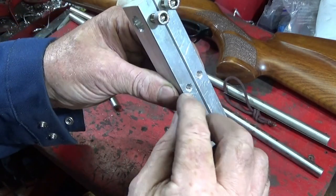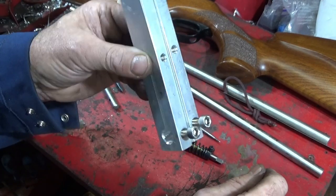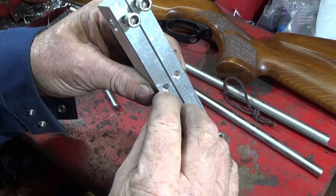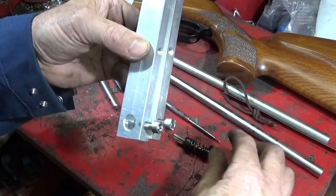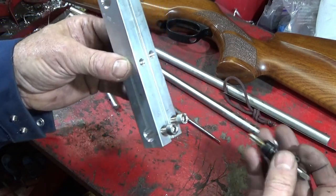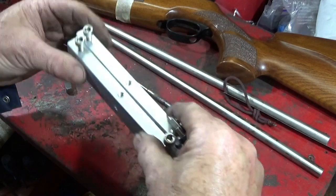Often when you do screw tapping, you have to deburr the end with a cone or a burr, and that sometimes throws up another burr inside the thread, which you have to clear out by putting the screw tap down again. But these tools made by Drill Pro cut all that out.